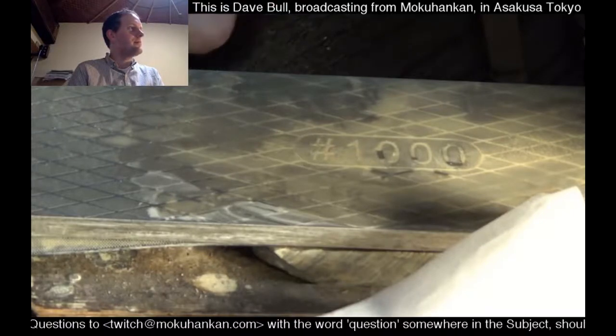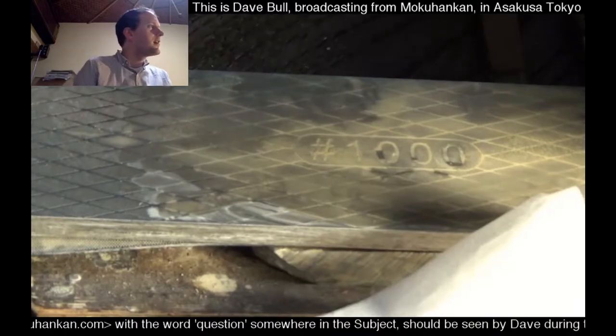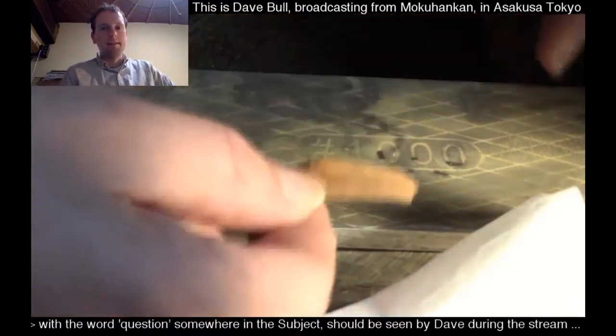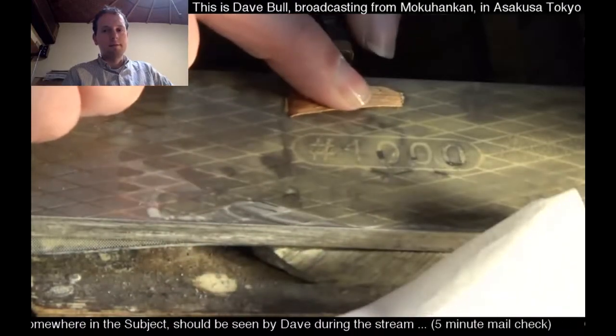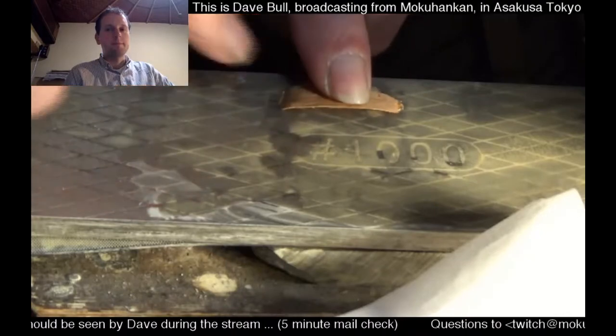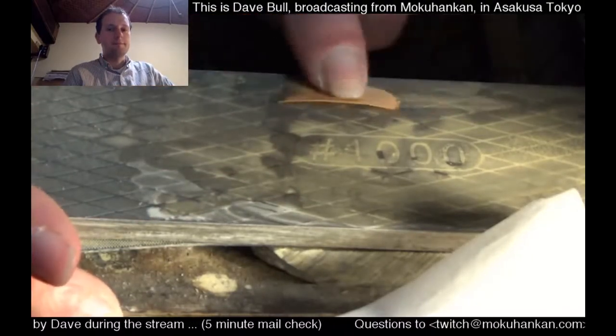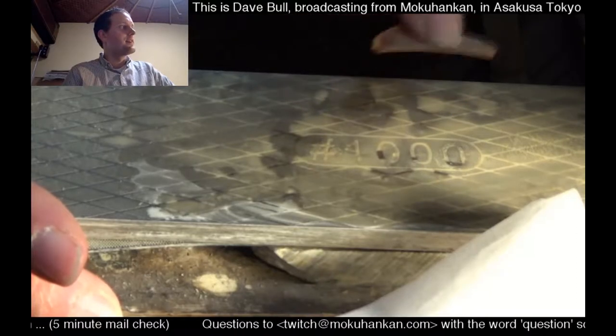Here, this looks like it might do. So you grab a wood chip from under your bench, which is a curved chip, and use that on the back of the blade like this, and that acts like outriggers on a canoe, right? It helps the blade stay flat instead of rocking side to side.